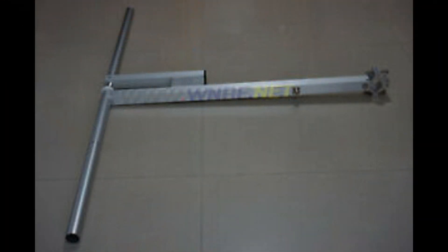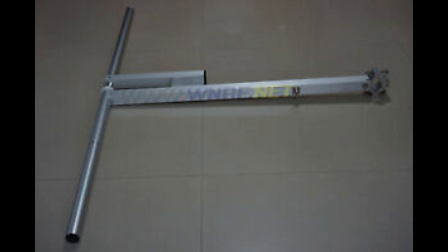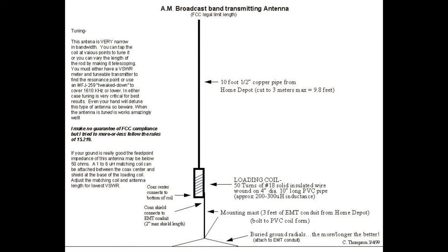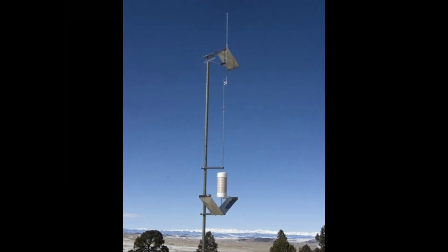Antenna-wise, an FM community radio station is going to be a lot easier to set up. It uses just a J-pole or a stand-up dipole antenna, and you just adjust the height for the signal that you want. You also have the ability to build your own antenna — it's a relatively small-sized antenna to get a relatively good amount of gain. AM antennas, due to the Part 15 rules, are limited to an antenna height of 10 feet. That's not a lot of height when you're talking AM, which is a much longer wavelength, so you're going to have to get real creative to fit inside the confines of the Part 15 rules.